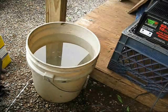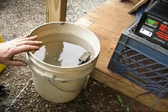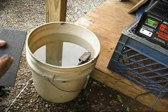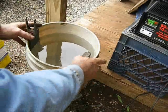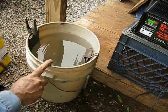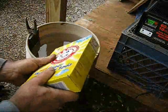The way I set my electrolysis tank up is as such. I've got just tap water from the faucet in the bucket — a five-gallon plastic container. These are those carbon plates that I cut earlier. The electrolysis is line of sight, so you put one on one side, one on the other side, and they'll meet each other. You can put two more in, which I do occasionally, and it'll get all four sides. But for this demonstration, I'm just going to go with the two.